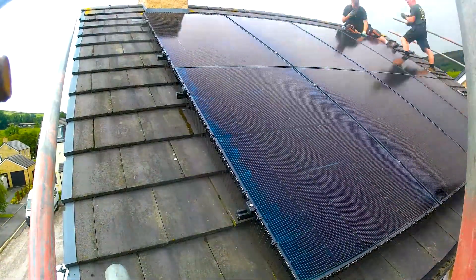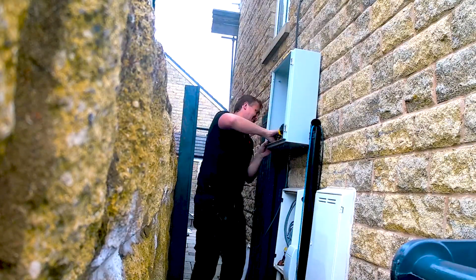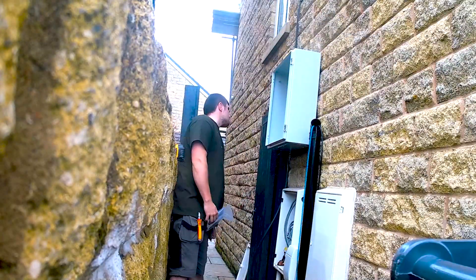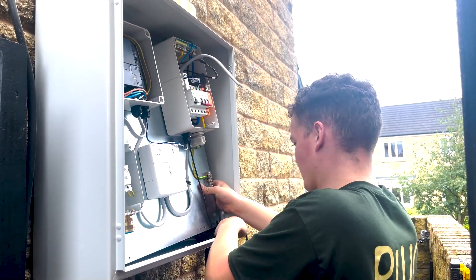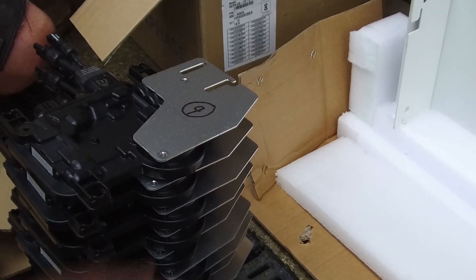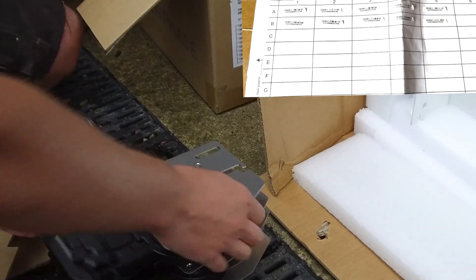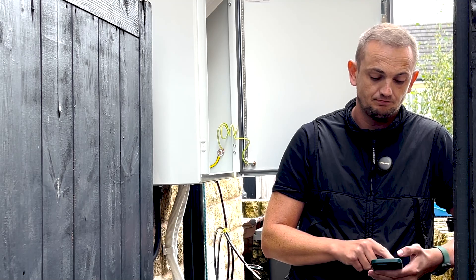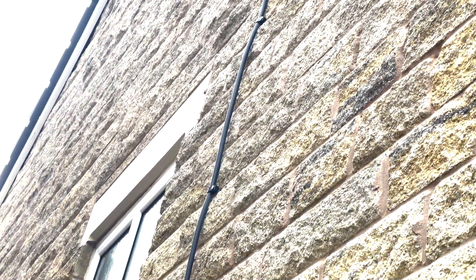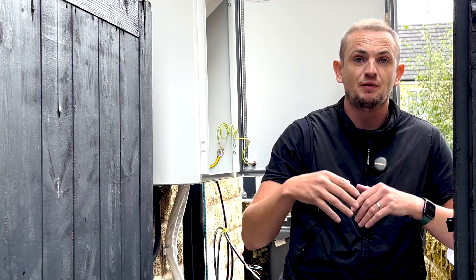Is the system ready to go live? The system is ready to go live. I'm absolutely freezing, but everything's installed and powered up. Next job is to commission the system — we're going to assign an address to every panel, so with this system you get individual control over each panel. There were barcodes on the bottom of the microinverters which the guys used to build an array map, and that array map gives us all the information to build out the system. The armoured cable coming down is all AC — the DC is only the tail off the panel into the inverter, and after that we're full AC.